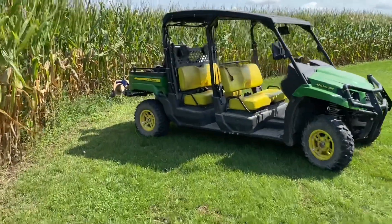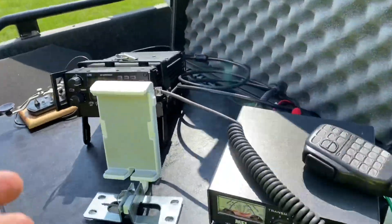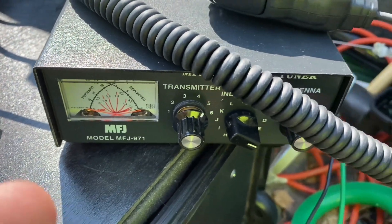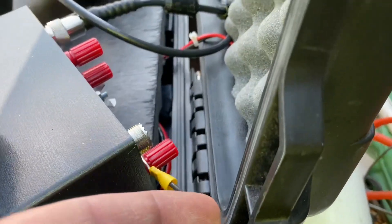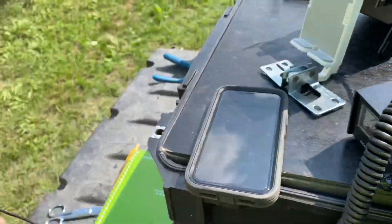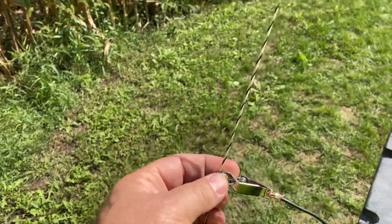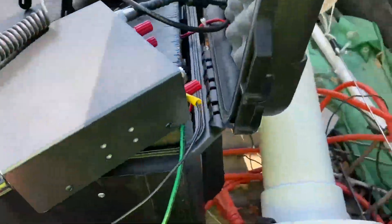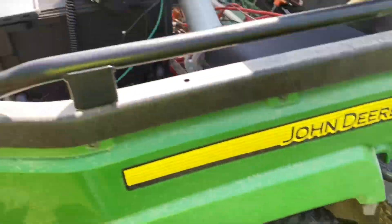I've got the radio coming into my tuner and I got it tuned for one-to-one. I got the wire coming out off the wire lead of the tuner, going over here and just clip it onto the wire tether line for the kite — there's wire inside that nylon. Then I've got my ground coming here, going down to ground in the ground.